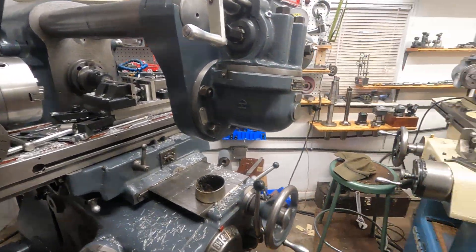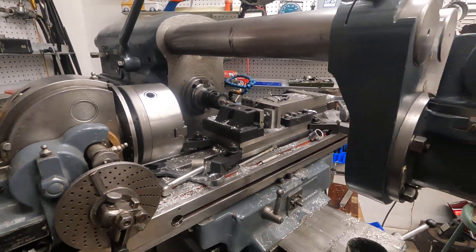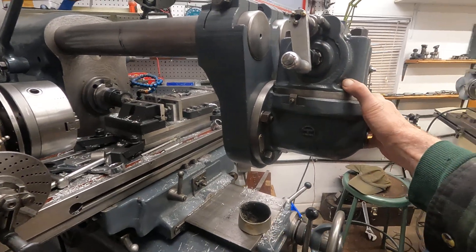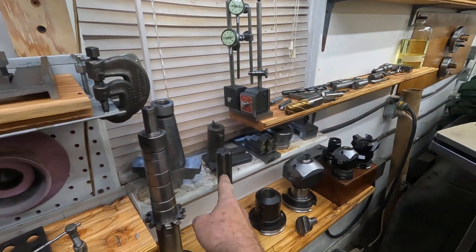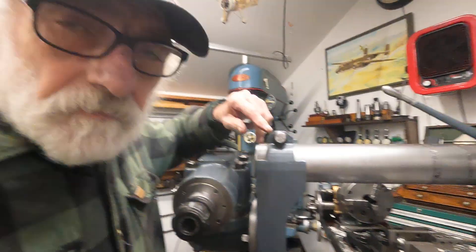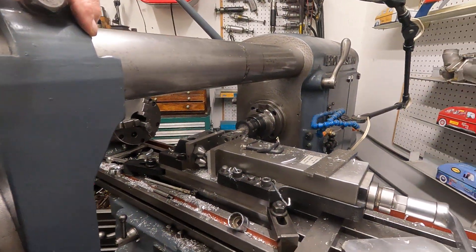This horizontal mill I used exclusively on that attachment over there, and I did all the functions on it with the vertical head and the horizontal spindle. It switches from vertical to horizontal really quickly — this stays on here and it's driven by a spline. So instead of an arbor, you put this spline into the horizontal spindle and it drives the vertical head. I kind of got to use this machine for the first time just like making something. It is slower than a Bridgeport, but it does a really good job — just really nice.